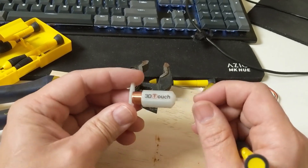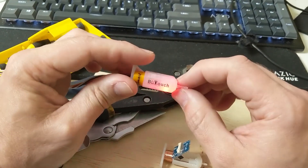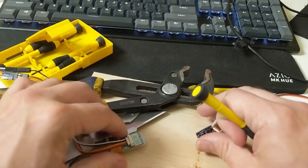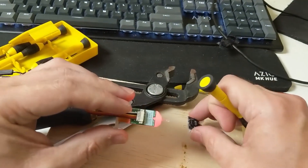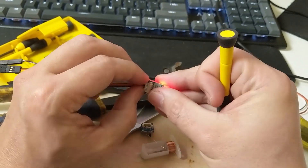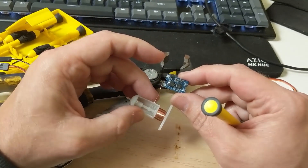So there you have it — a dysfunctional 3D Touch. That's how it works, and I'm going to assume they mostly cloned the BL Touch, so this probably works the same. I'm definitely not going to break into my $40 sensor, but looking through the clear plastic I can see the magnet inside the pin just like this one, and the faint outline of a chip. It's probably identical — the PCBs are about the same size and the clips that plug in are exactly the same.